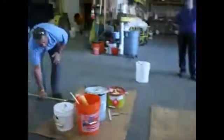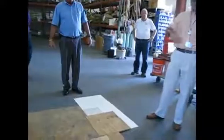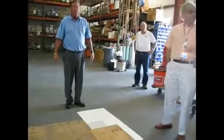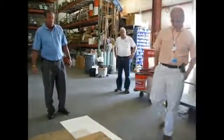You didn't cure the primer? You don't cure through the layer because it's clear. So in doing a big floor, are you walking in spiked shoes — is it dry enough to walk on? Depends on how long you have. Usually when you wait 45 minutes you can walk on it with soft shoes, apply the material, kind of like tack pads before you walk on it. No spikes because it's going to ruin the wood.